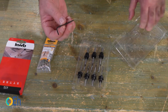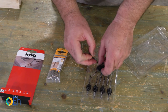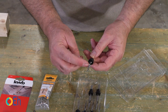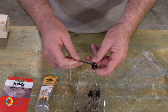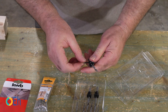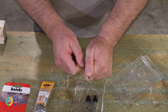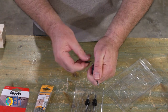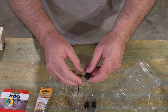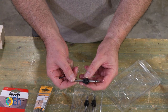They have a small Allen wrench used for the following. We are going to work, for example, with this 5mm countersink. We can adjust the depth that we want to give to our drill bit. To do that, we release this depth stop with the key. This has a grub screw, and when you work with grub screws you have to be careful to hold the Allen wrench well because sometimes the screws are very hard and, as it is so fine, we can break it. Fortunately, it's easy to replace an Allen wrench. This first stop allows us to regulate the depth we want to give to the hole.